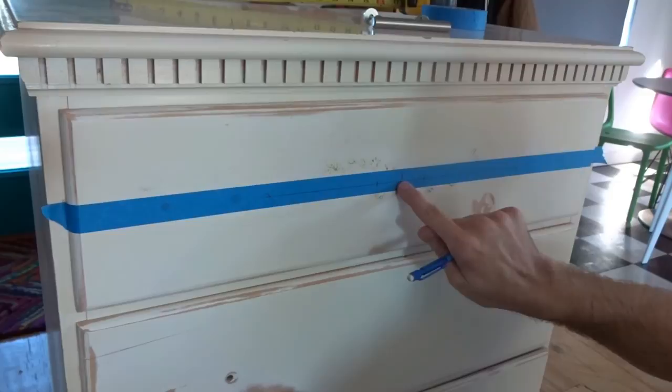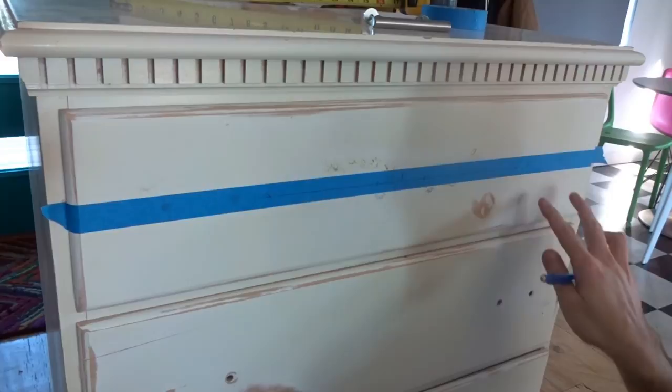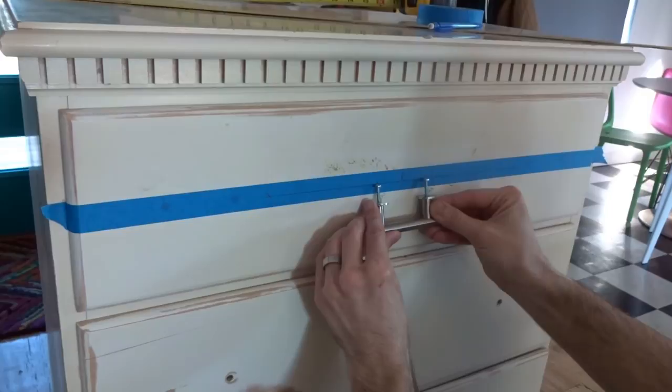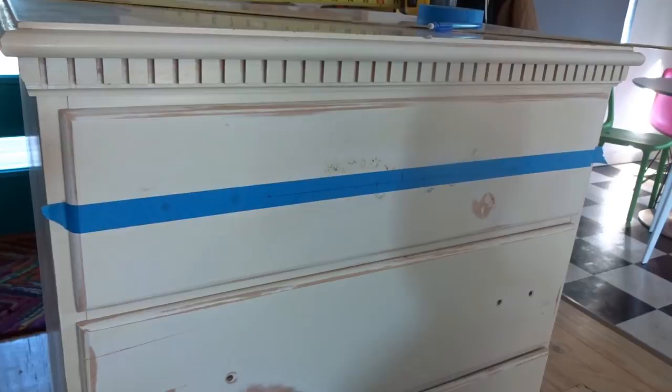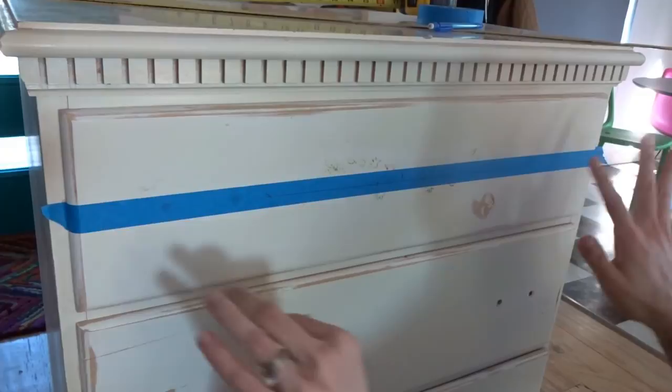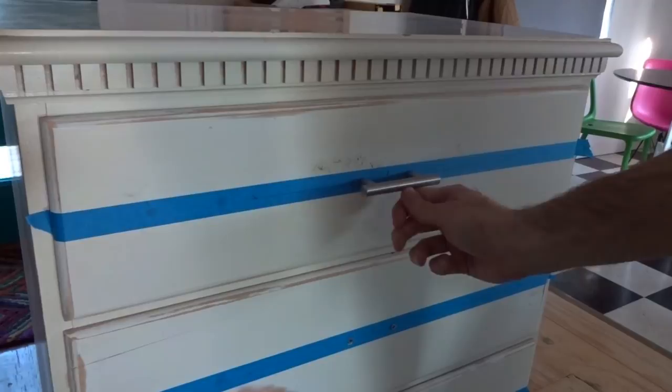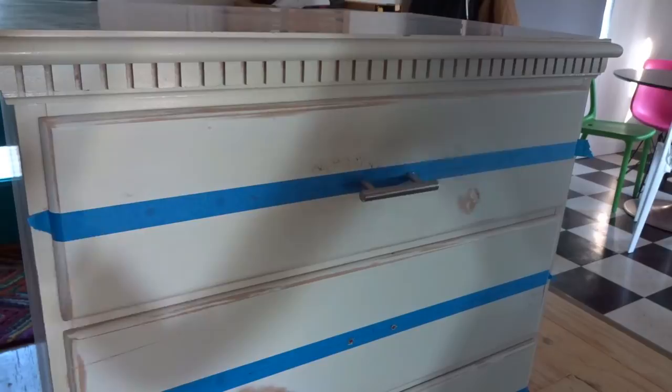I figured out center — it was 13 and 1/8 inches across, then 3 and 3/8 inches down, and the holes were two and a half inches apart, so I went one and a quarter inch away from center to the right and left. Double-checking — it fits just right. The bottom drawer is a little deeper so I'll re-measure for it, but I can start filling in the holes and doing all the Bondo work. Look at that — it fits perfect. Now I can start filling the holes and get this thing moving.